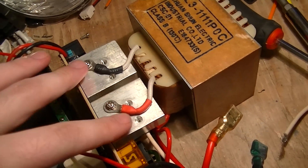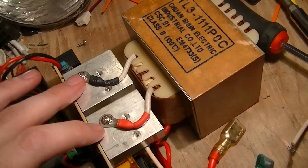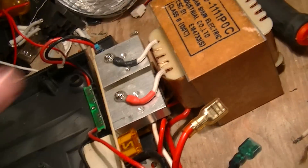There's a pair of heat sinks, one for each of the two end taps on the transformer primary winding, and each of which has a couple of MOSFETs on it.